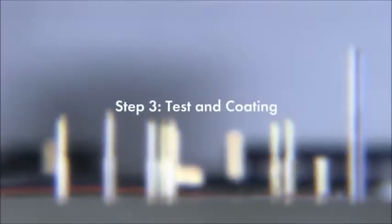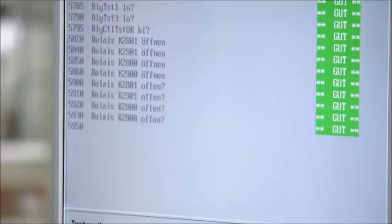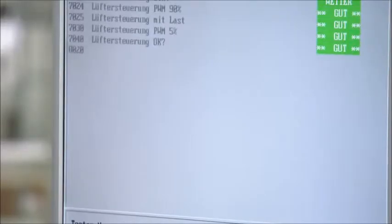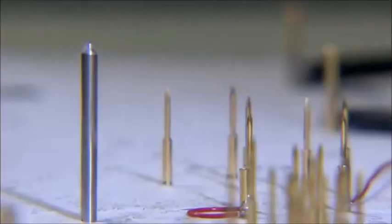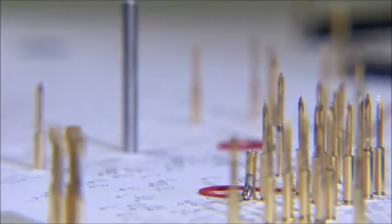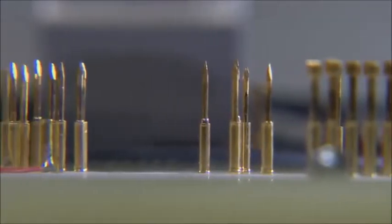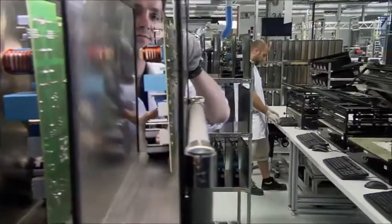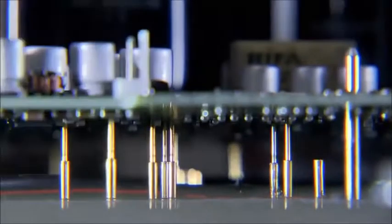Last step: test and coating. Once cool, each board is electrically checked. Are all of the components in their place? Are they the correct values? Does the board perform electronically? For each type of circuit board, there is a matching testing device — a rack with up to 800 fine contact pins. When closed, the pins touch corresponding contact points on the board, so that currents or testing signals can be applied and measured.